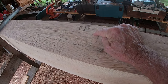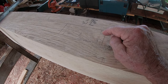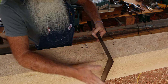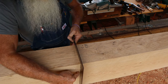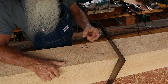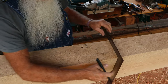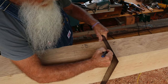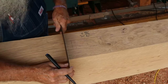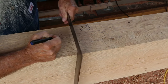I've got a couple of these cut out — it's a bit slow because there's a lot of chiseling involved. I have one laid out here; I've gone ahead and scored the lines, and I've got some faint lines which will be a guide when I start to drill to remove the waste. I'm marking two inches and four inches — that's the width or thickness of my tenon — using a fine-point felt-tip pen so it shows up a little better on camera.